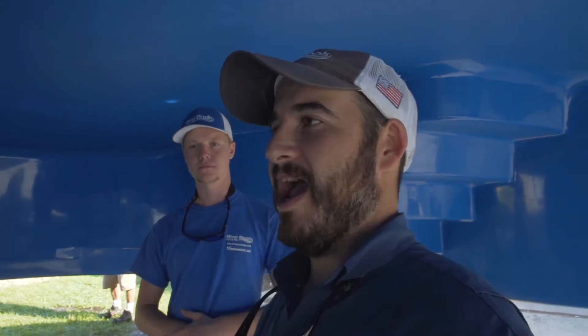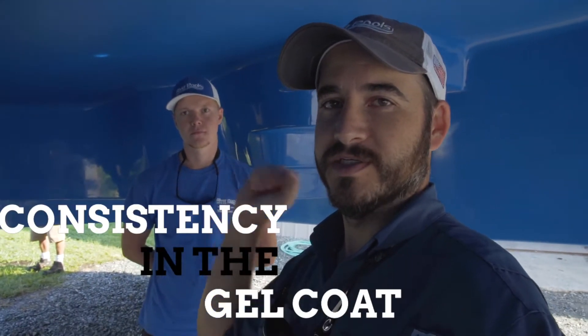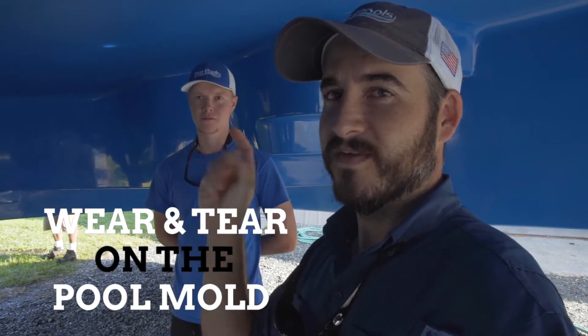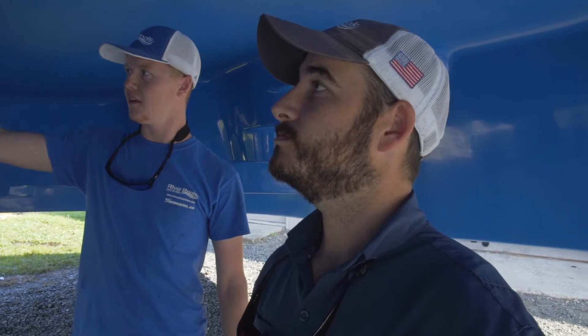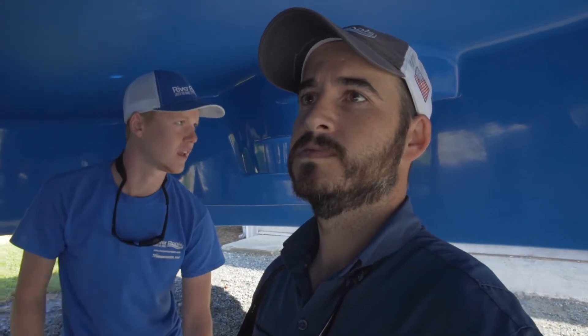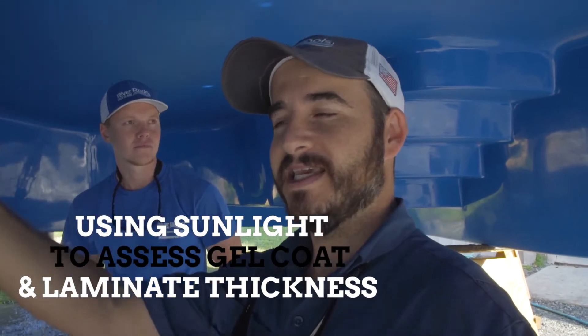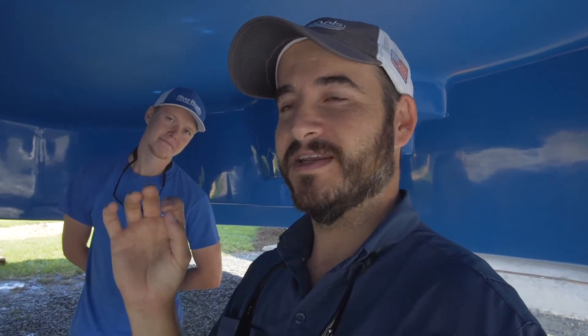This pool has been washed inside and out. Matthew's going to perform two inspections — one with it upside down, one with it right side up. The three things he's looking for are: consistency in the gel coat, spider cracks, and any signs of wear and tear through the mold. To check for consistent gel coat, you use light — you'll be able to see from the outside in and spot the uprights of the honeycomb, and see light going through. He's looking for thin spots in the gel coat and laminate using sunlight. Dark and light patches would indicate inconsistent gel coat and inconsistent thickness in the laminate.